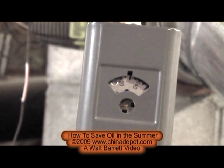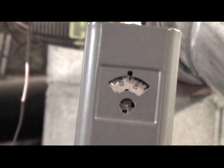I hope this is some help to you. This particular control on our furnace is a Honeywell, but they're pretty well all the same. Look around your furnace — some of them are above the boiler, some are on the front of the boiler, but it's clearly marked 'temperature' and there will clearly be a screw there to adjust it. Thank you very much.